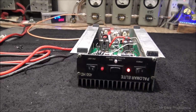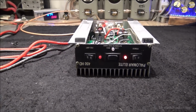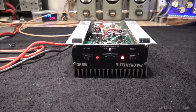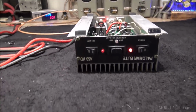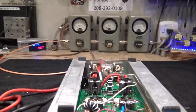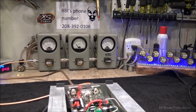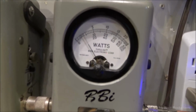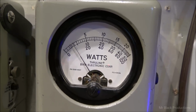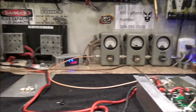Now, the guy that owns this box has got like a 35 or 45 watt radio. Okay, now what I'm going to tell you, Mr. L, is you're going to run this in the high position. And where I want to see you key it, it's right about there. See that? It's about 75 watts. You key this thing at 75 watts, it's going to last you a lifetime.